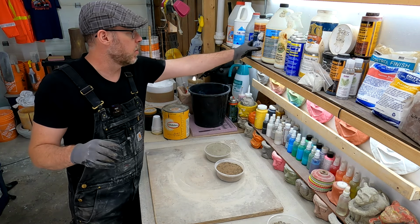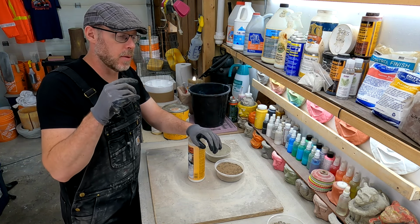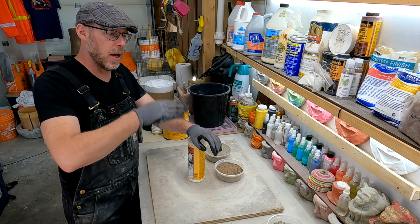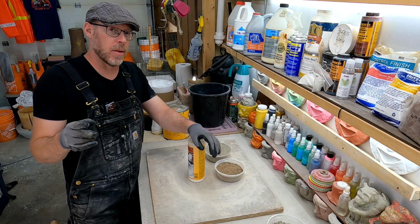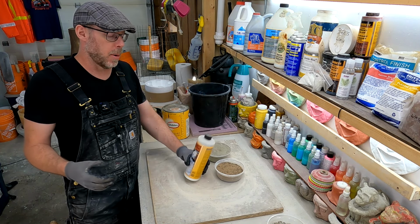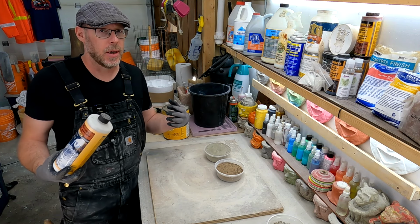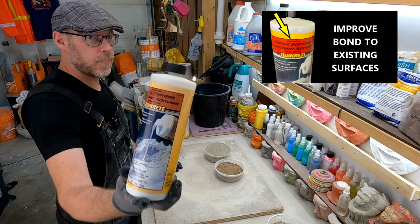And so here's what we're going to do. We're going to drastically enhance the potential for bonding and for a feathered edge without having that long-term breakage. And we're going to accomplish it more or less the same way that the bag products go about doing it. We are going to add an admixture. They add a ton of admixtures. We're going to add at least this one.